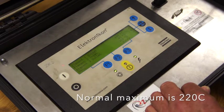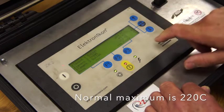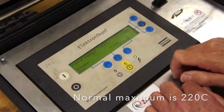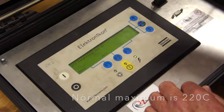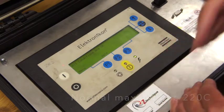Taking it up — 195, 196, 197 — we're going over 200°C now. Remember it should be set around 220°C for a trip. We've now got to 219°C. As we've gone past that, the machine has completely tripped. We got a warning at 219°C and then after we went past 220°C to 230°C it tripped the compressor. That's basically simulating a warning and then a trip.